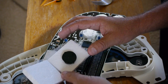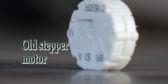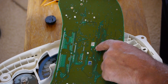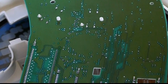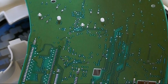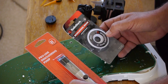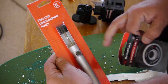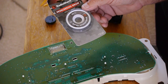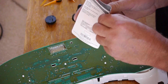That's this one right here — be sure that it compares, and it does. You can see the four points that were soldered: this point, this one, this one, and this one. We're going to use either copper braid or a solder sucker — I'll show you how both work. We're going to unsolder this servo using two different methods: a soldering sucker and desoldering cable or braid.